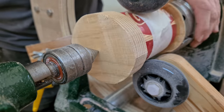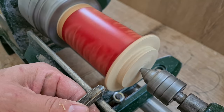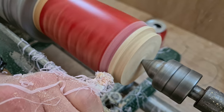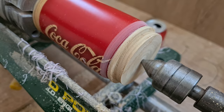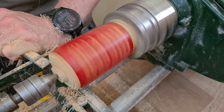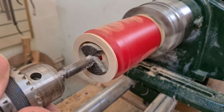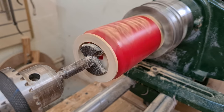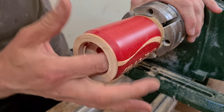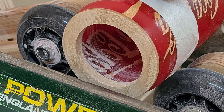Here we're just going to epoxy glue in the new base and again leave it overnight because I needed a strong interface to generate a tenon from which to put it into the chuck, reverse everything again and then deal with the lid. This was an unbelievably fiddly part of the project trying to deal with such thin amounts of wood. I had taken some measurements before placing in the rim but it was very concerning as to how much room I had to play with, so it's just proceeding as slowly as possible — a bit of a risk calculation. I managed to pull it off, I think.